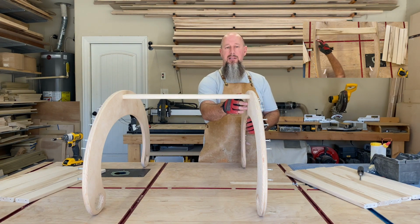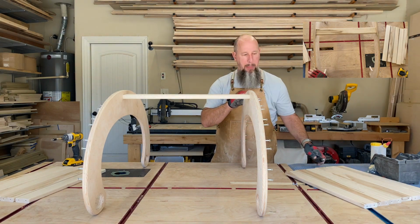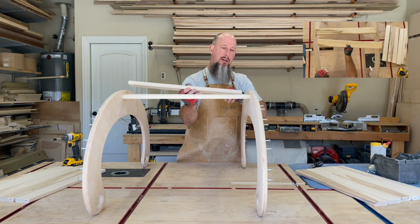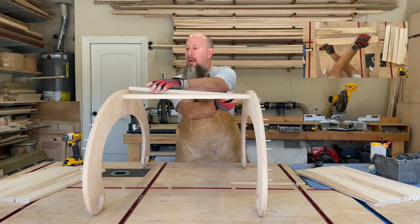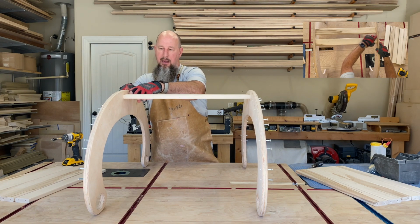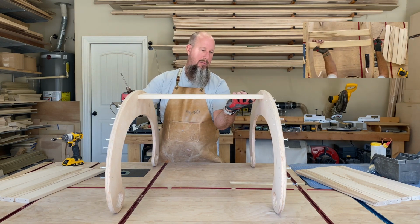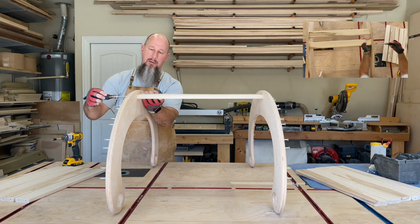This side here, you can see the screws are poking through about 1/8 of an inch up to 1/4 roughly. The reason for that, again, is I'm going to touch those holes that are there. It kind of helps me align that one side as I bring this other side down, and I want to use my screwdriver. I'm not using my impact driver right now to drive these. I'm just wanting to make sure that we are inside that hole. It is extremely important that we hit that.